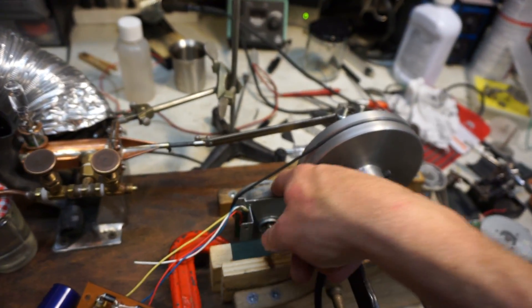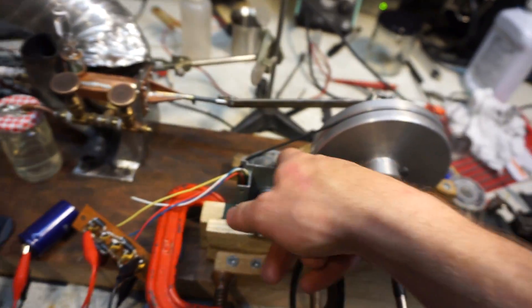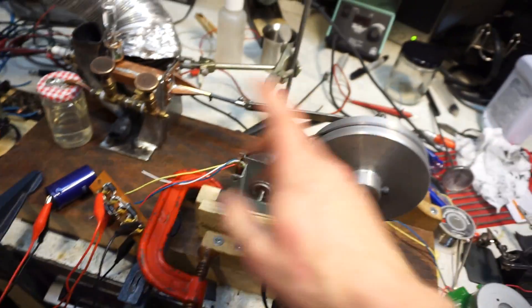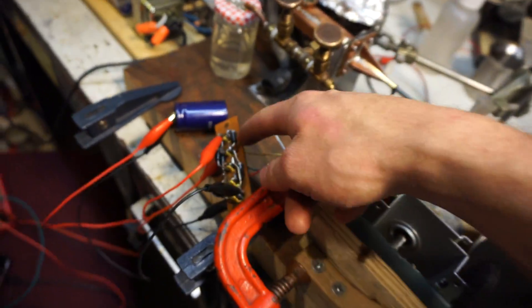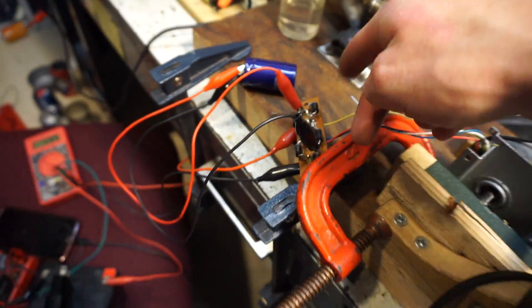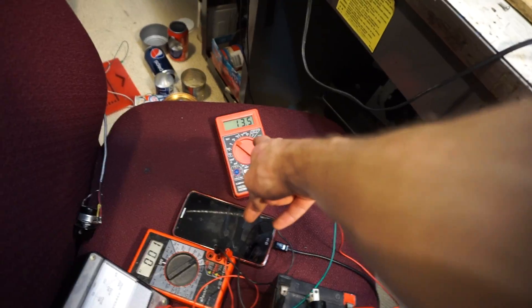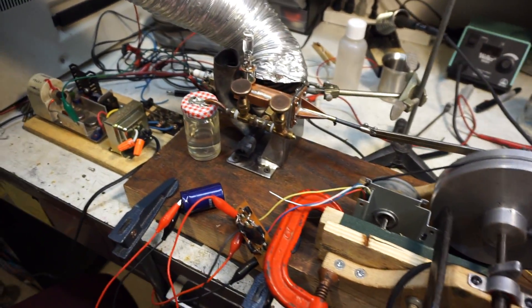This one actually will put out about 30 volts max, which is not bad at all. So about 15 watts for this engine. It's going into this little three-phase bridge rectifier diode setup — six diodes that rectify it into DC — and I'm charging this battery right here. We've got voltage there and current here. So without further ado, let's power it up.